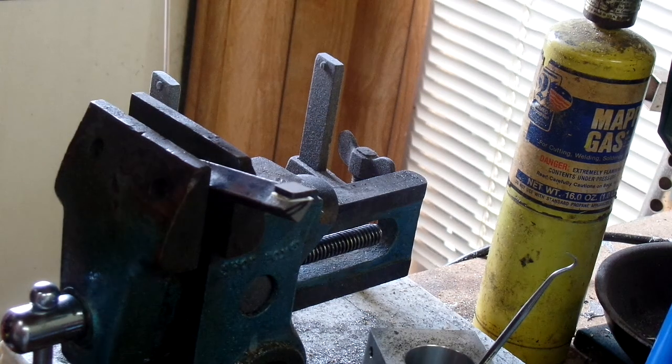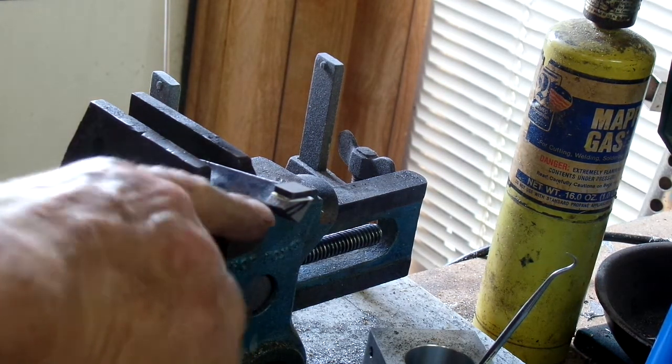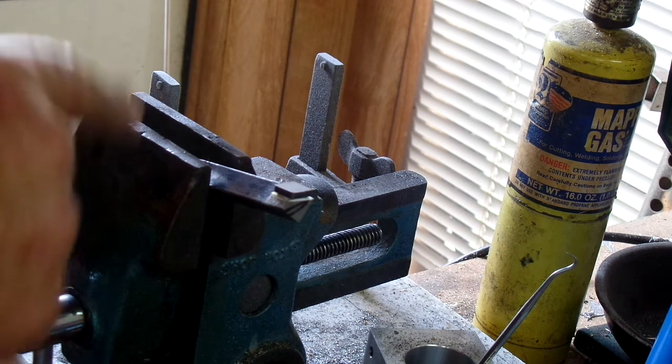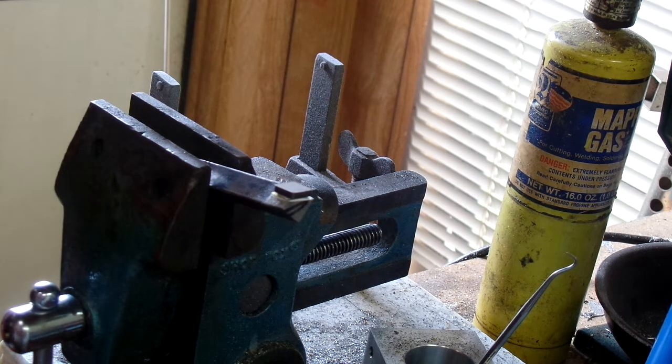What I'm going to show you is a brazing carbide tip. I've got a piece of shim stock, six thousandths thick, and I've got Boraxo — 20-mule-team Borax — on the top and bottom of the shim. I'm using a big tip here because it's propane, and the reason I'm using propane is it's cheap.